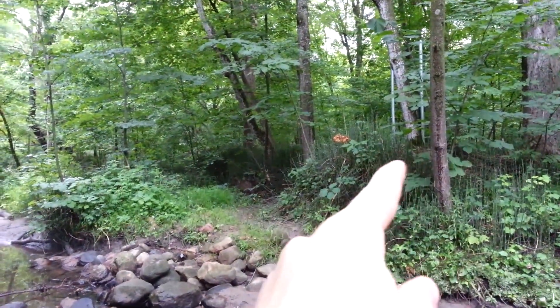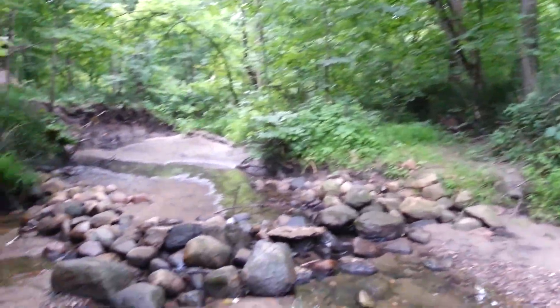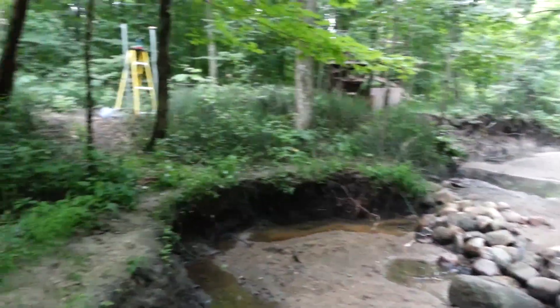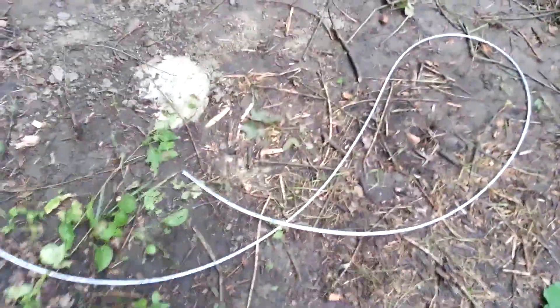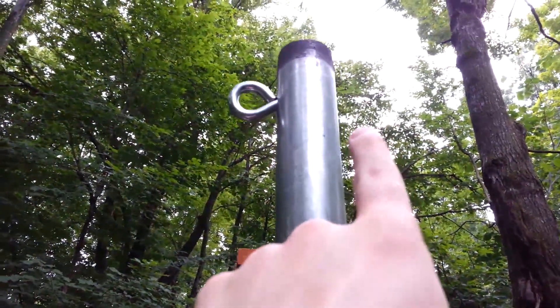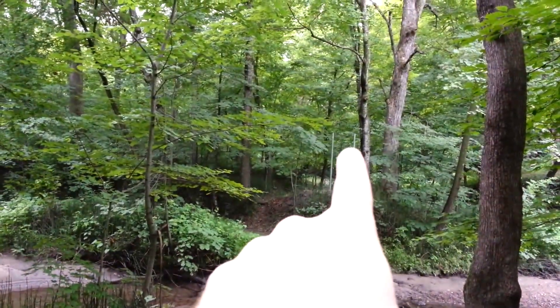There are the two poles on that side. It's a 54-foot span to those poles. From here down to here there will be a static cable with no turnbuckle on it, just to stabilize it. The turnbuckles will actually be on this side. I haven't put the eye bolt in yet, and then it'll obviously go across to there.